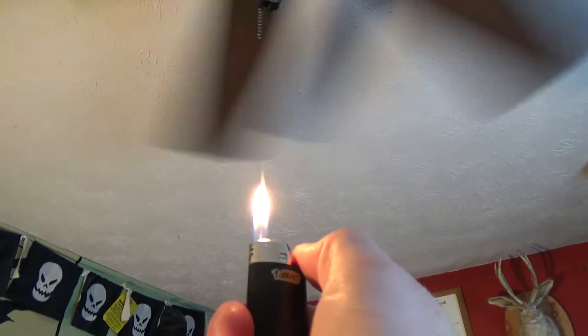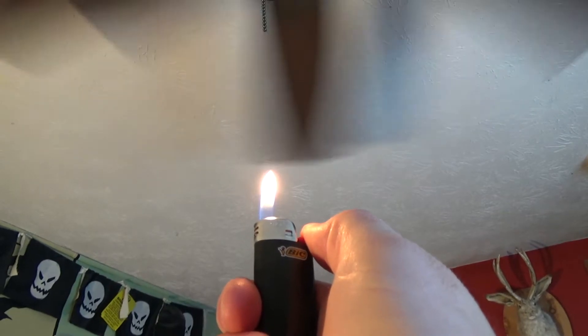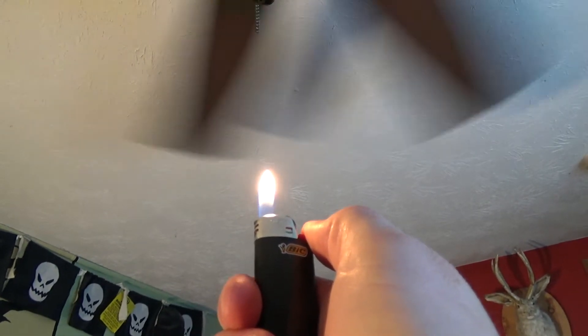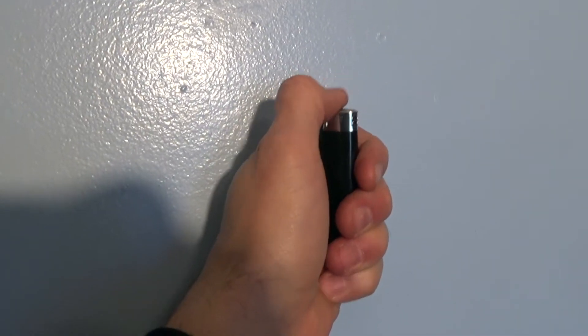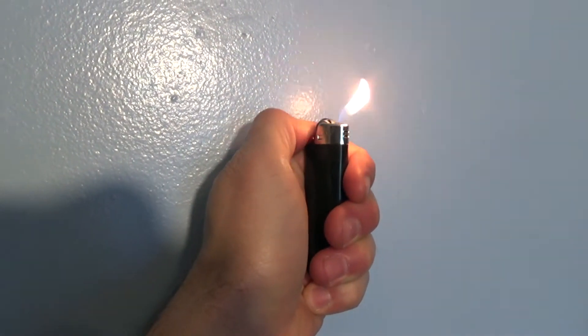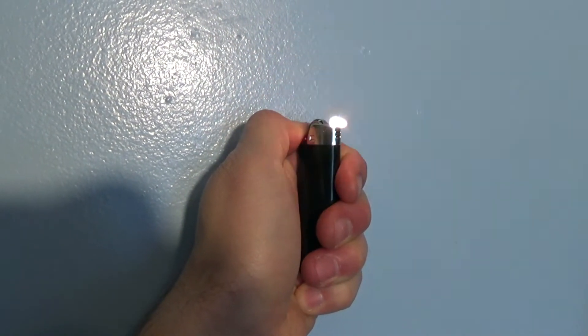In the winter time, you can strike a lighter, match or candle directly under your ceiling fan and you'll see that the flame stands straight up because the fan is drawing air up from the center of the room. It's blowing the warm air that sits at your ceiling down along your walls, so if you strike a lighter along the wall, you'll see how the flame dances.